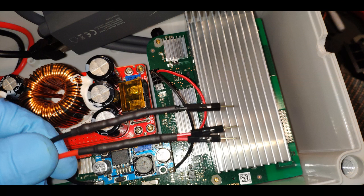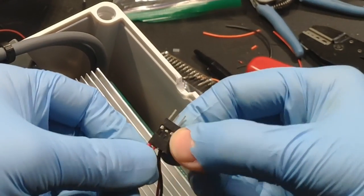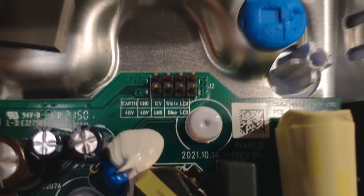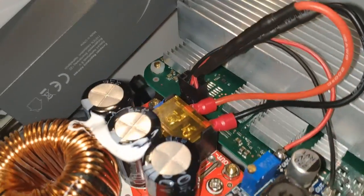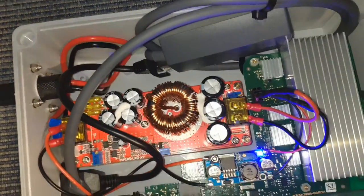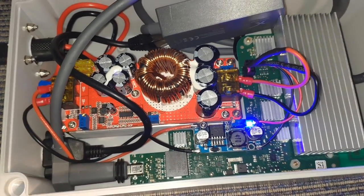I used regular pin connectors to connect the two power supplies to the circuit board. This connector supports eight pins but I'm only using five: for the 50 volt supply there are two positive pins and one negative; the 12 volt side has a positive and a negative. The rest of the pins are for LED lights and a ground — since this is a vehicle I left those unused. Despite 48 volts being printed on the board it was actually putting out 50. I made sure voltages were correct on both supplies beforehand; out of the box the big power supply had a low voltage cutoff adjustment that was incorrect, indicated by an LED on the board.